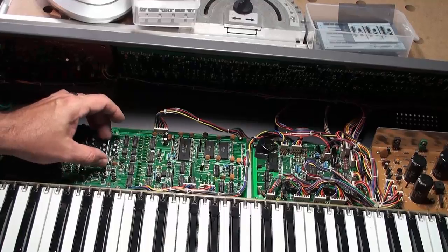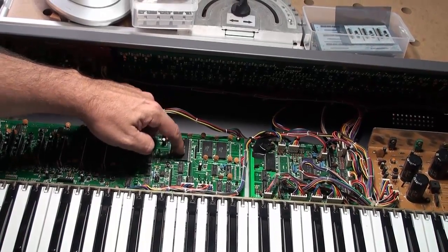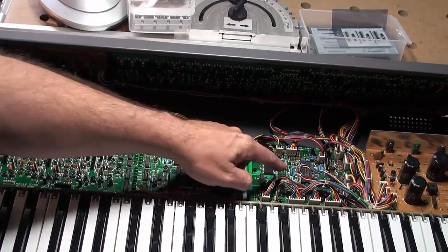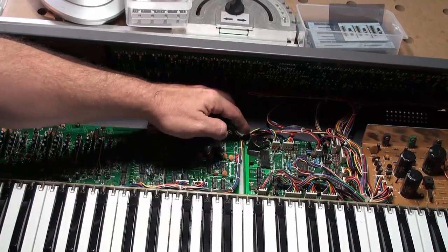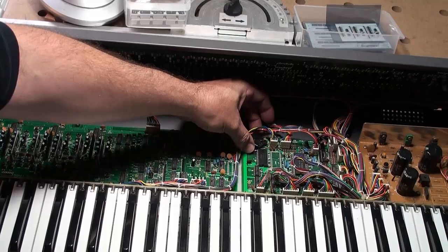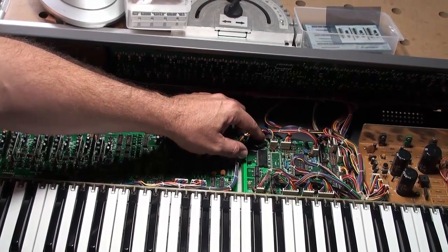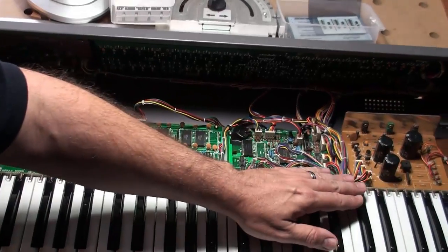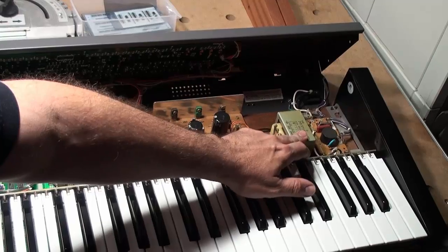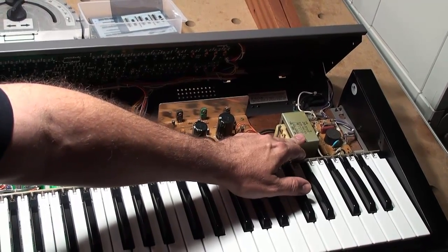I asked BT about this, he said he actually had it done. This has been serviced and, of course, this is the original voice assigner chip that's got to come out in order for the upgrade to go in. This is the original CPU board and it's had a battery update. Someone's put a piece of electrical tape over the top of it to stop it from shorting out or popping out the battery. Over here is the power supply, and the power supply is one of the multi-tap versions for North America and can also do 220 and 240.